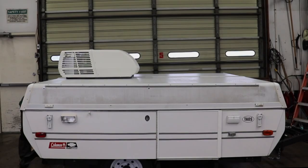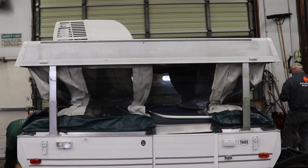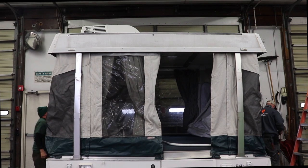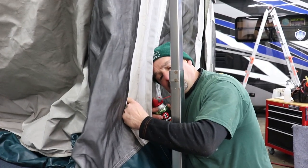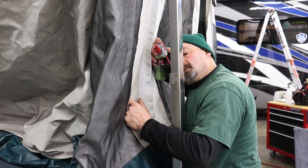Next, raise the roof. Now it's time to service the lift arms. Each lift arm has up to four pulleys. They are located at the bottom butterfly bracket and at the top of each stage, with the exception of the very top stage.